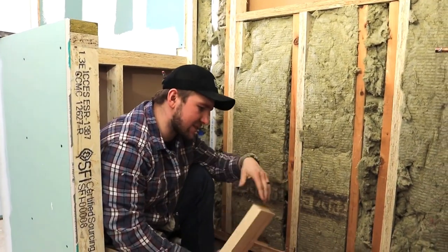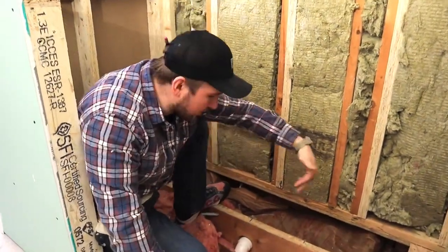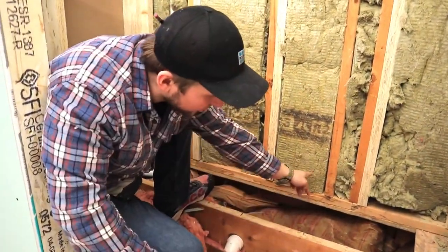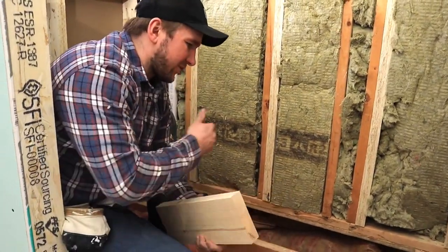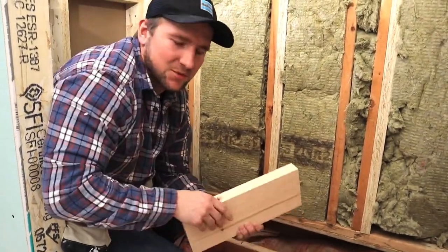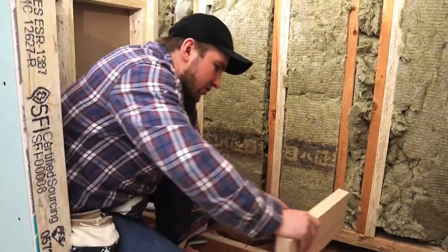The way we're going to fix this is we need to get some type of structural support from this floor joist to the other floor joist. I'm just going to use a couple of 2x6 blocks — we don't have to have them every 16 inches, you just need to throw a couple in there.